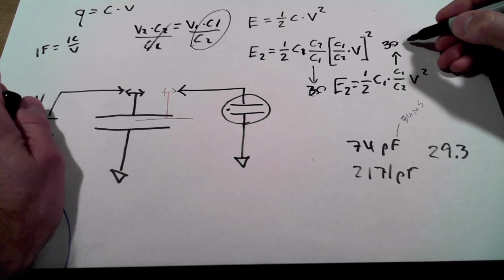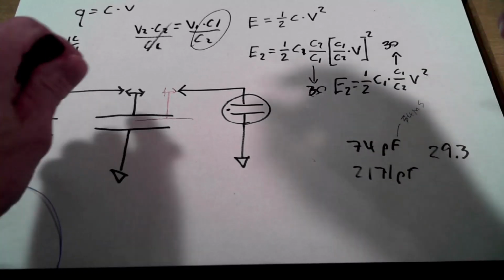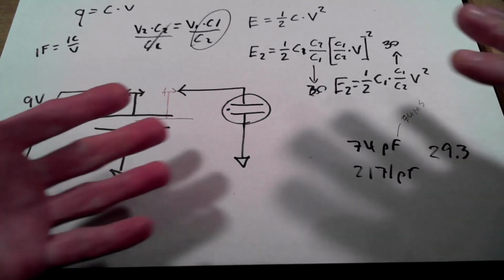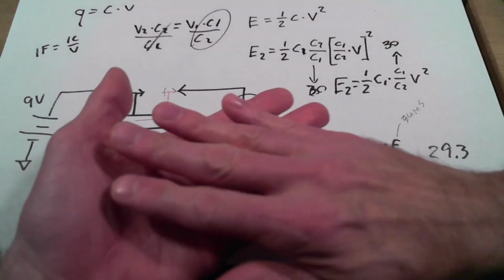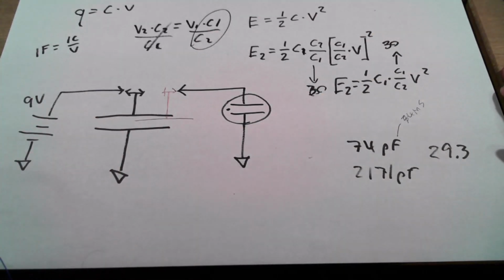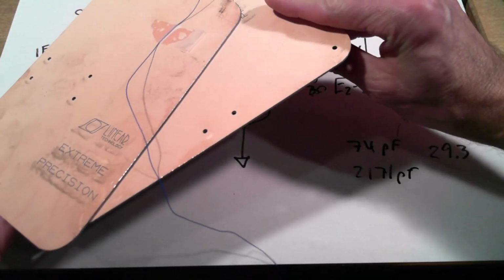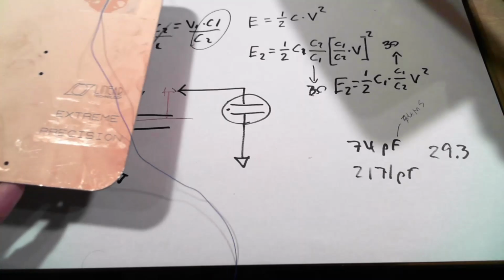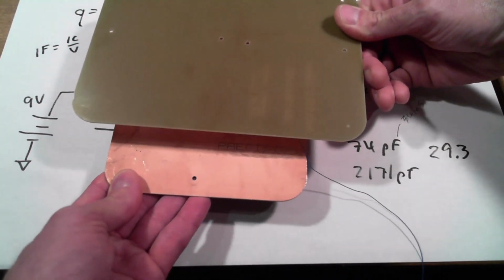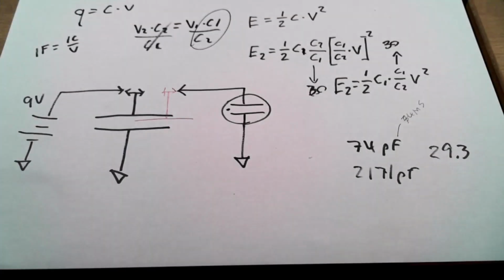How cool is that? We got something for nothing, didn't we? So how can that be? Well, it turns out that as we're sliding this capacitor, as we're moving the plates apart from one another, there's actually an electrostatic force between the plates. And that's what we're going to show in our next video. I've already got proof of concept on this. We're going to take 2 copper plates, put one of them on a kitchen scale, and measure the force when we apply a high voltage between the two. But again, that's for the next video.